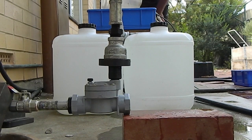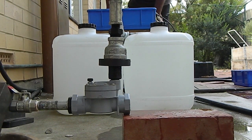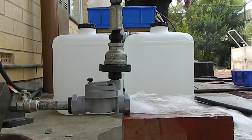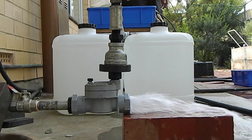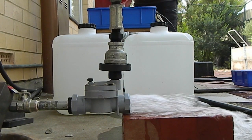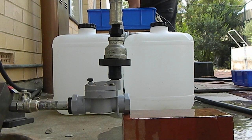The ferrite ring magnet assembly slides over the solenoid. This option is only appropriate when there is a 25mm clearance around the solenoid. When the magnet moves from the high position to the low position, the magnet lifts the plunger inside the solenoid and opens the valve. When the magnet moves from the low position to the high position, the plunger is released and the valve closes.